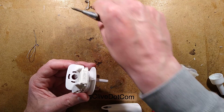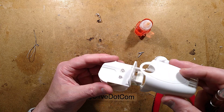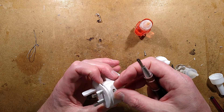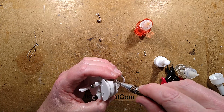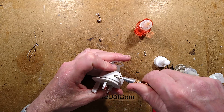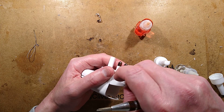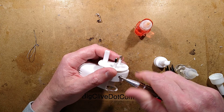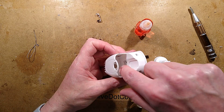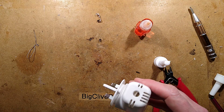Okay, take two with fresh LEDs since the other ones have been decapitated - well, one of them has, and it's gone scorched black inside. That's nice. It didn't blow the fuse in the extension though, which is good. LEDs make extremely good fuses - they just make that little pistol-shot crack and a bit of plastic flies off the front. It's resulted in lots of disappointment - I've been trying to blow LEDs up deliberately and they've just done that controlled failure thing. This time it's not going to blow up - probably. I mean, I didn't think it was going to blow up last time and it blew up while I was holding it. It could have done with being more violent just for extra drama. I cropped the LEDs down - I did that thing where you cut the lens off the front, it just makes them a bit shorter. Three millimeter or straw-hat LEDs might have been a better option.